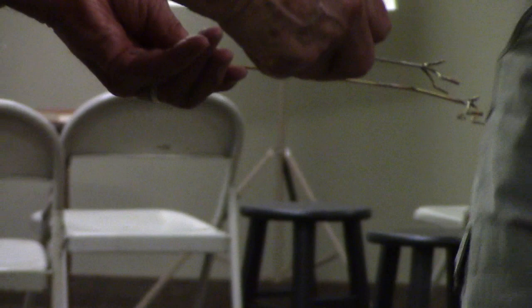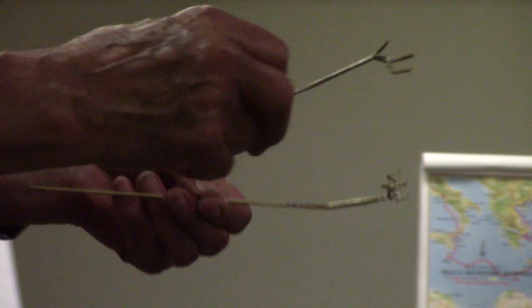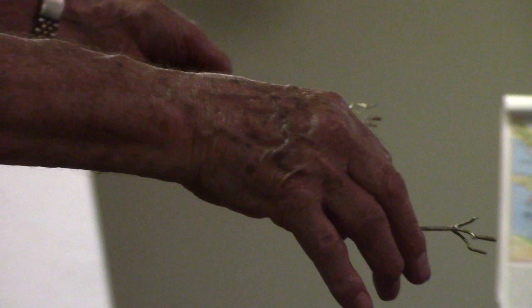Is that regular solder or silver solder? That's also a regular solder. In other words, these days it all has silver in it. But silver solder is something that's a very high temperature. Yes. I've got it here, I'll show you what it is, but you use your butane torch and high temperature to do it, or you want extreme strength, it ends up being stronger than the brass. So if you really want a strong joint, say you've got a big bird and it's being suspended on just a point, you use that there.